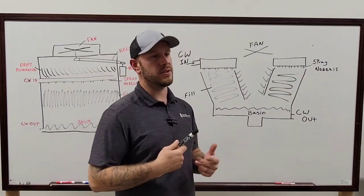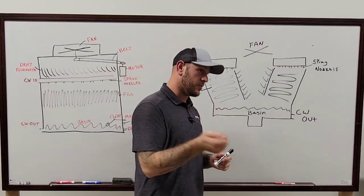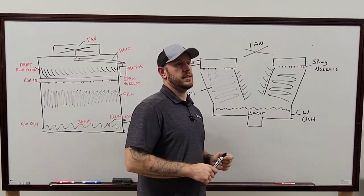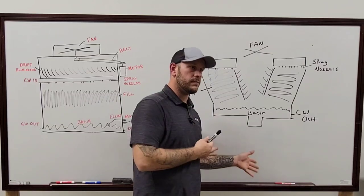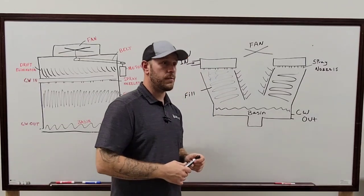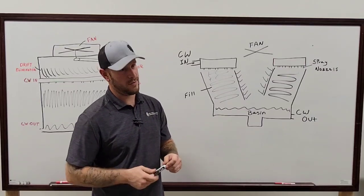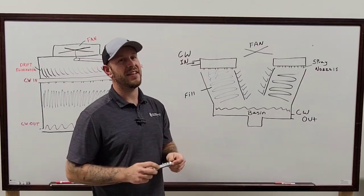Most of the time, what I personally do is I take my flathead screwdriver and I don't hit it with the handle side. I just hit it with the flathead side. Since we hit the beam it's mounted to. Yeah, exactly. That's exactly what I was going to say. You hit the beam next to it, which then controls the vibration switch and kills your signal. Most of the time, if you notice that it tripped and it did not kill your signal, something else is wrong, and you need to start troubleshooting. That's why we keep finding out with all these dings.